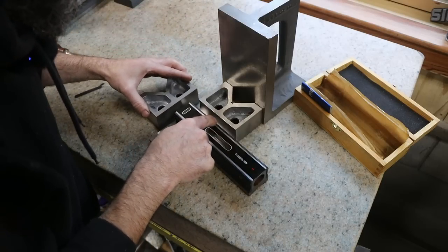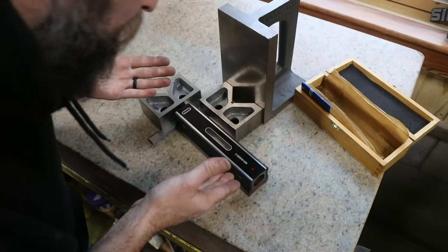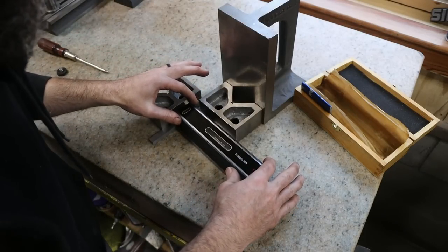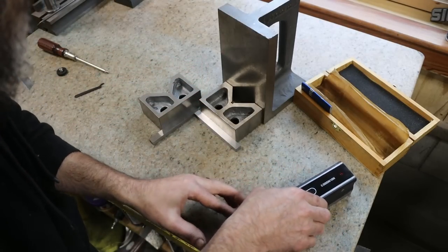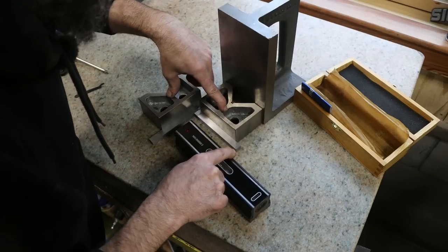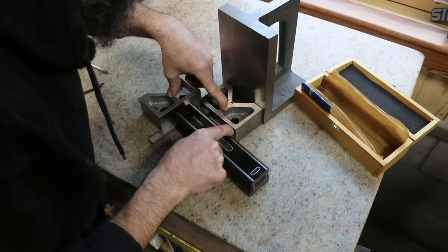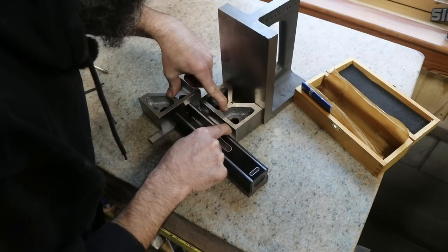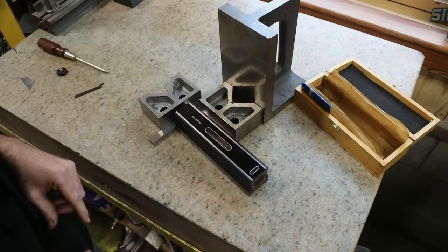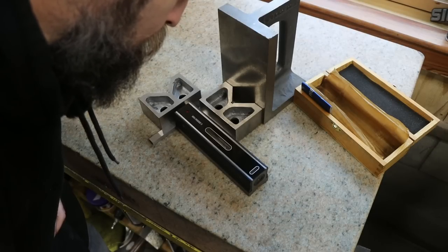Okay. So I'm just building the fence. That's all I'm doing. Now check. Is it still in the same spot? Yes, it is. So now I'm going to take this level out of its position and I'm going to rotate it 180 degrees and I'm going to come right back in very carefully and put it in the same spot. So if this level is calibrated, it should read exactly the same as it did 180 degrees out. And it is super close.